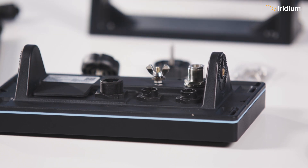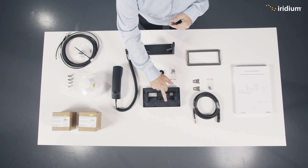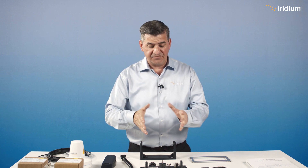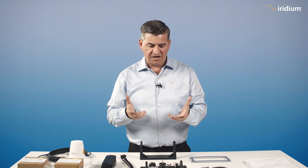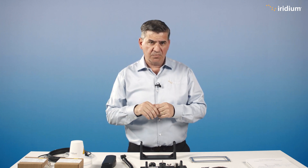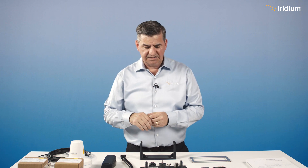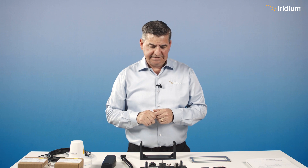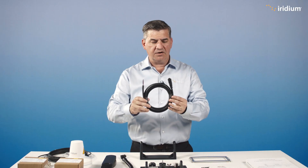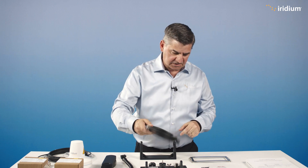The I/O port — input/output — includes an external ringer for loud vessels so a big bell lets you know the phone's ringing. You can also send information to other devices: GPS in RS-422 format, bridge alert monitoring alarms (BAM), and maritime safety information to a plotter or ECDIS via RS-422. Next is the power connector — two wires, black and red. Always use a certified installer. The antenna connector screws onto the fitting on the unit. Last is the earth connector — again, always use a certified installer.